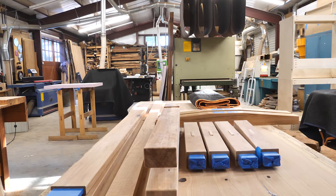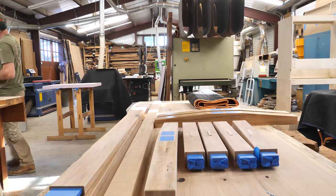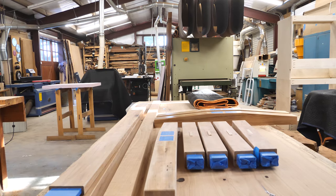I want to jump in and talk about this glue-up. First time I've ever done this in any furniture piece — I fully finished all the parts before we assembled them. We sealed them with a sealer and then put two coats of conversion varnish on them, that's why you see the blue tape on all the joinery. Obviously we don't want finish on our tenons and mortises because then the glue won't grab. The great thing about doing it this way is everything's done once you assemble the table — it's just a little bit of cleanup. You also don't have to worry about the process of cleaning out glue squeeze out, which can take a lot of time.